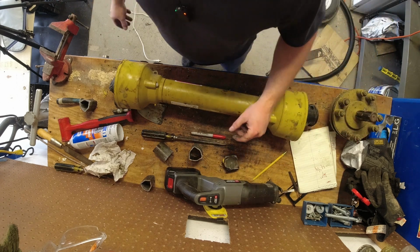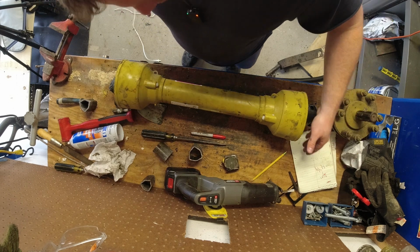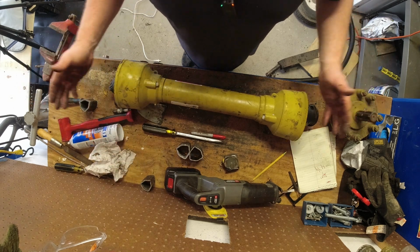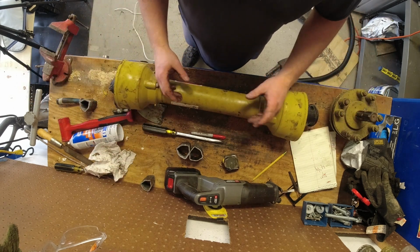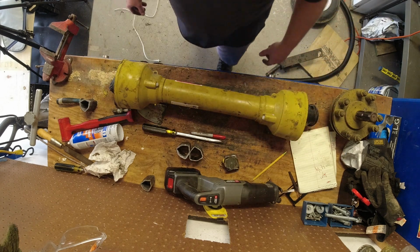All right, that's it. Thanks for watching. Real quick, so what do we learn? We learn that you take the full amount out of each end if you want to shorten the shaft. Makes sense because it's going to bottom out on something, and it's got to bottom out the whole length. So, all right. Thanks for watching.